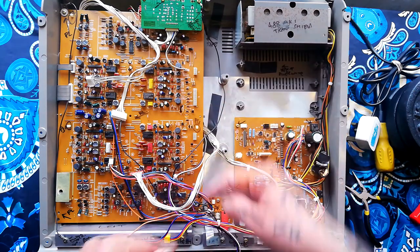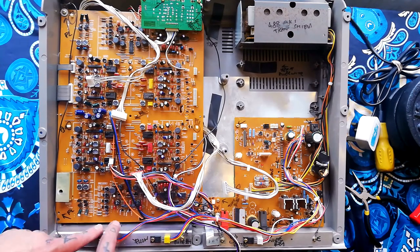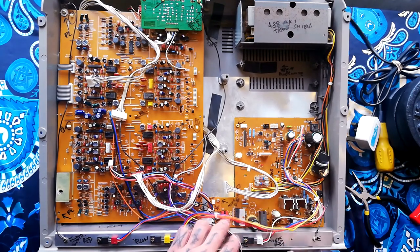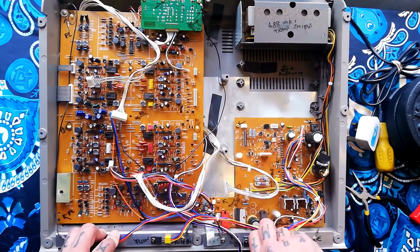What I suggest you do is write the wire color beside the voltage regulator but leave the voltage regulator in situ. On some models there's thermal paste between the voltage regulator and the metal plates they're attached to, and I don't want to disturb that. So as long as you've written with a marker pen that white goes there, yellow goes there, red goes there, you can remove those connectors.